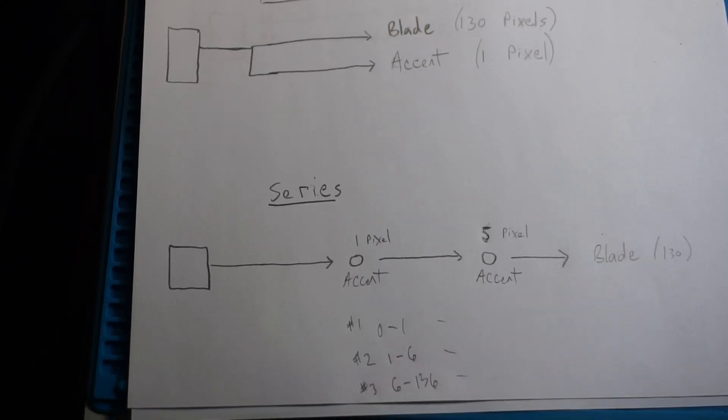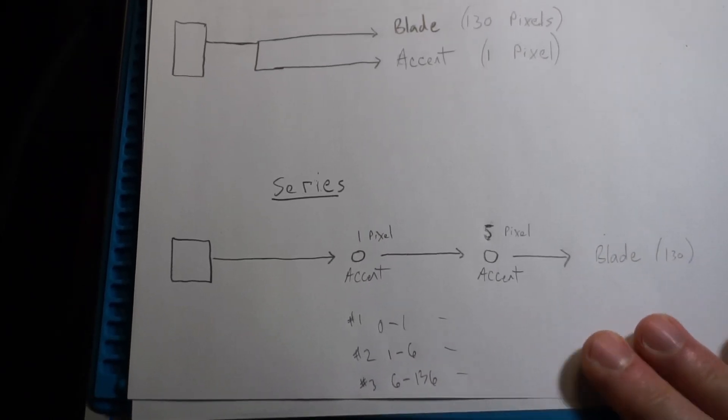In your preset where you style these, you now have the ability to style each of these independently. Sub blades in series with one data line allows you to control as many things as you want. There's really no upper limit outside of just running out of power if you're trying to power too many pixels. So that's in series — and you could consider this a more complex use case.